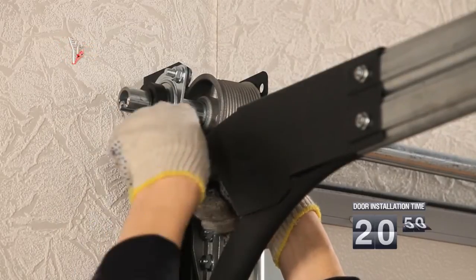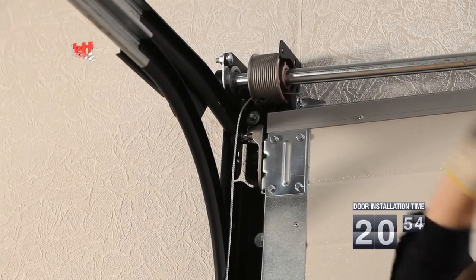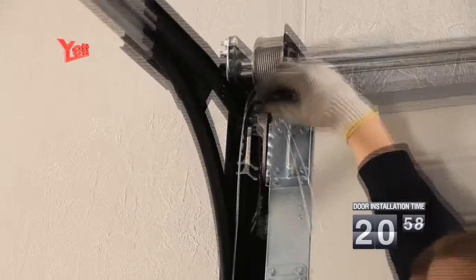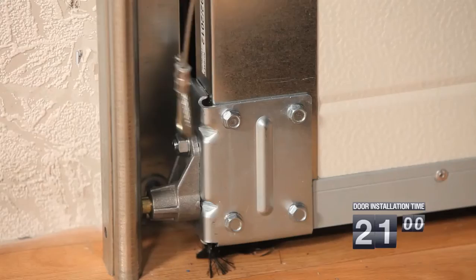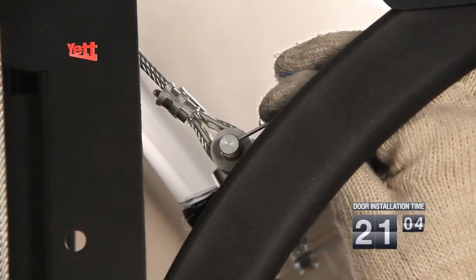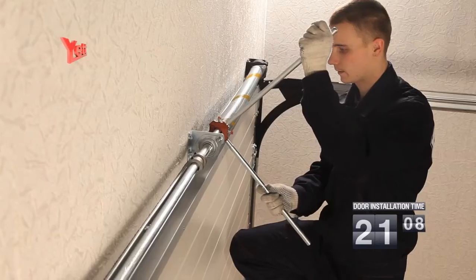The pull rope is bent around the roller cage and stretched along it to the drum of the torsion mechanism. A thimble is fixed on a special fixture of the bottom lateral buttress pier by means of a washer kit and a split pin. The pull rope tension should be identical on both sides.